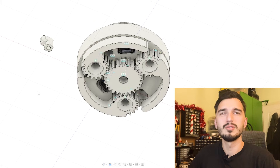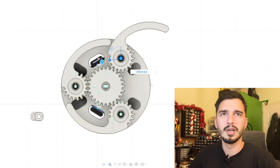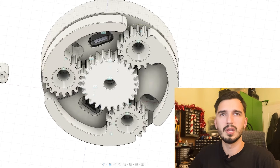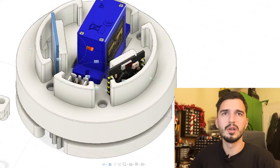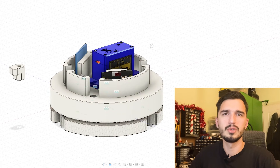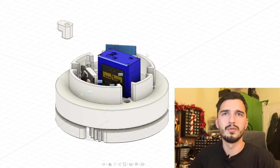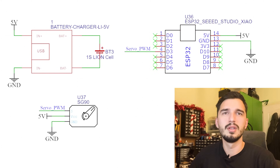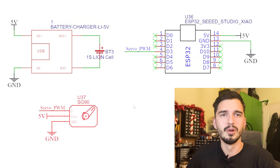Let's model this out and 3D print it. Here in Fusion you can see the mechanism, and if we try moving one of the swing arms you can see that when it opens up it can pass through the neck of the jar. In the center we have the central gear spun by the SG90 servo, and around it a connector and some electronics. For the electronics we're going to need a microcontroller, a battery charger which also converts battery voltage to 5 volts, and a battery. We only have the ESP32 because of its tiny size — you can also use something like the Xiao boards, they're more than powerful enough. All of the code will be linked below. We also have the USB charger for the battery and the small SG90 servo.